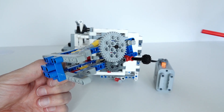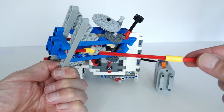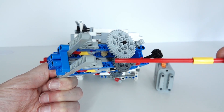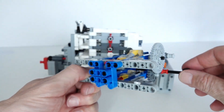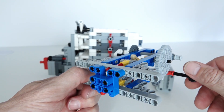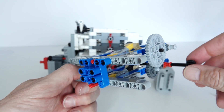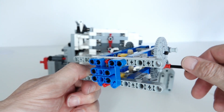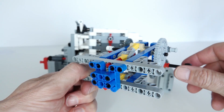In this design I've got a main axle driven by the motor, and that axle drives each of the crankshafts which in turn drive the pins. I've used a different gearing ratio between each of the crankshafts in order to drive the pins at different speeds. What that means is that as they turn in and out, you need exactly 15 turns of the main axle in order for these pins to line up again and be able to release the timing mechanism.